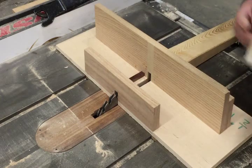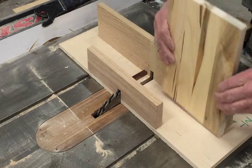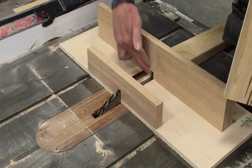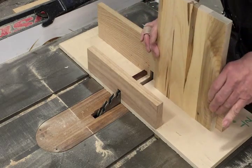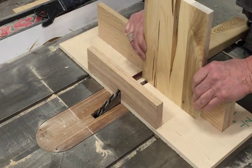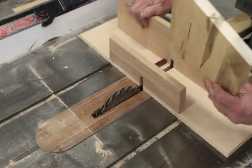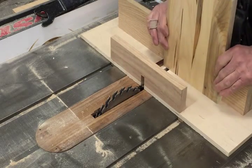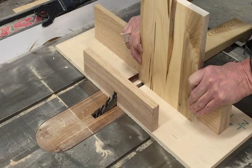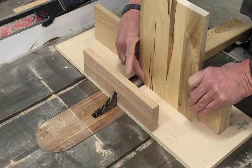When we make this cut, you're going to cut one side like that. Put it down tight — make sure there's no sawdust in this area. Put it down tight against the phenolic stop. Hold it like this — not like this, not like this. Hold it down tight and snug. You can see your hand is plenty of distance away from that blade. Don't put your hand down close to it.